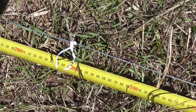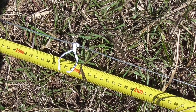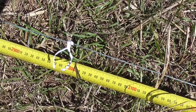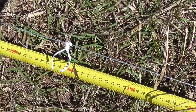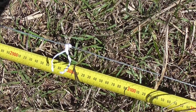The reason I've used that is because I can't find my longer tape, or I would use 6, 8, and 10 metres. The more you scale up that 3-4-5 rule the easier it is to make an accurate job. However, it can be very accurate at 3, 4, and 5 — or even 30mm, 40mm, and 50mm — as long as you are super accurate.